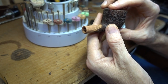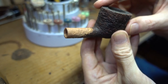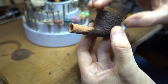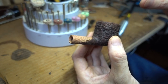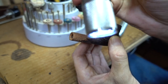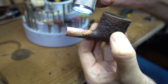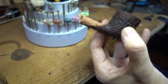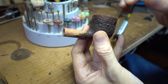We've taken this as far as we need to with the high-speed steel cutters. The best way to check your texture: as soon as you go from dark to light, it gets more difficult to tell the textures. I've got a bunch of bright lights on for the camera, but if you're working alone, shut off all your lights and use a little flashlight for low-angle light to get the shadows. That'll show you the highs and the lows. You want to be able to control your texturing so that it's the same depth and texture as the bowl, so you can match them without letting the dark and the light confuse your brain.